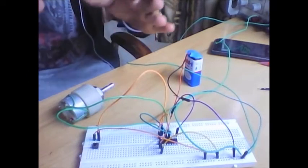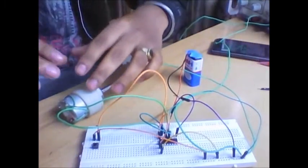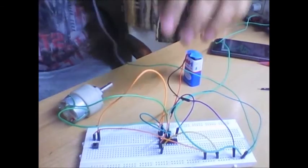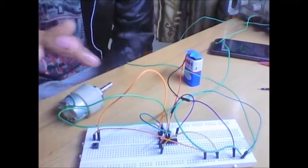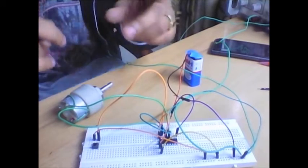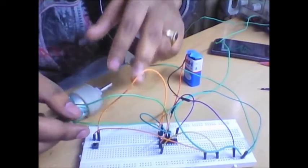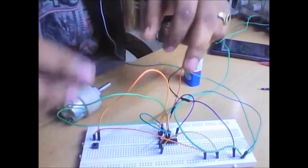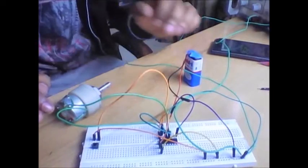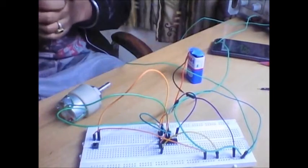Let me give a summary of what I have done here: I am controlling the rotation of a motor using a push button and the L293D motor driver IC. Pin number one and sixteen should be given five volt supply. Pin number two and pin number seven are the inputs. Pin number three and six are the outputs that connect to the DC motor. Pin number four and five go to ground. Pin number eight is the external supply — I gave nine volts here. Thank you, stay tuned — more videos are coming. Please like and subscribe.